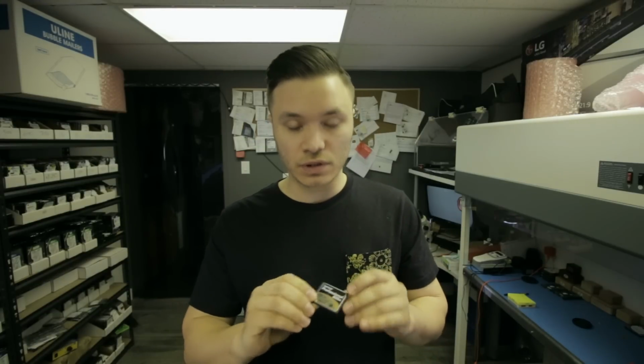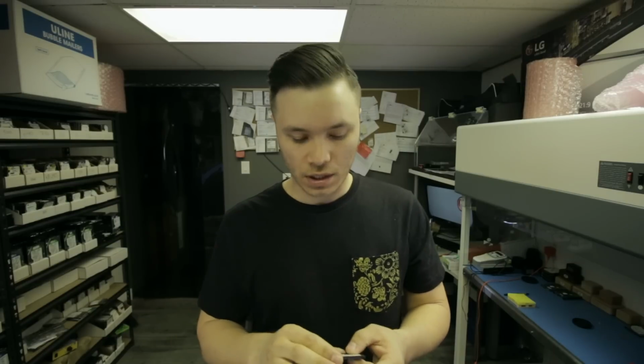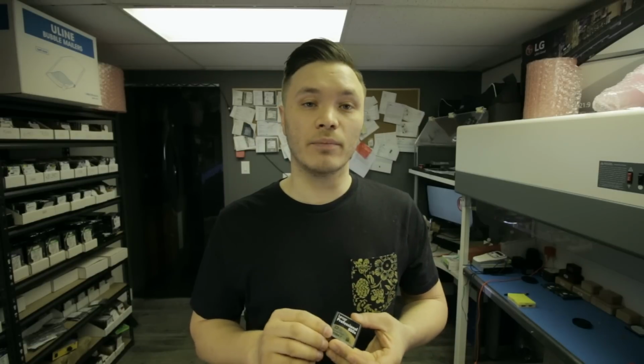Inside of this unit there might be one, but usually there are two or four memory components. So what we're going to do is open up this little enclosure, remove the printed circuit board, and from that circuit board we're going to have to desolder the memory components. After cleaning them up and reading the content off of them, we'll be able to reconstruct the logical volume to see the file structure again and copy the information out. So let me show you how it's done.